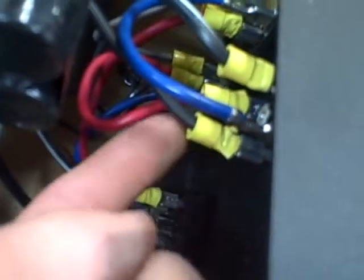Originally I had thinner cables from the AC to the rectifiers and they were getting hot — I thought I could go from 10 gauge to two 14 gauge wires to each rectifier, but they were getting too warm. So I upgraded to 10 gauge throughout, soldered the connections, and used spade connectors.